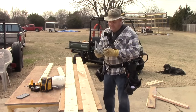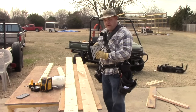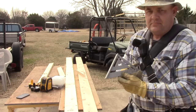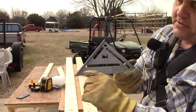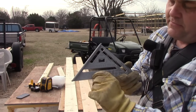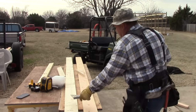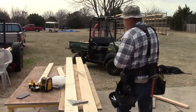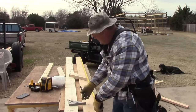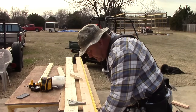It gives you calculations and makes a great square, a saw guide, but it also makes a really good protractor to work with. It gives you the values for a typical 4:12 pitch roof. These are your common rafter distances and there's a 4:12 pitch, so you're going to use that as an angle for my rafters. Here's your pivot point — we're going to use that for a 4:12 pitch. So first thing, I'm going to measure 12 foot because these boards are slightly longer than 12 foot — about 12 foot and a half inch from the mill. They can be either 12 foot one inch or 12 foot half inch, so you always want to measure them and make sure they're where you want them to be.